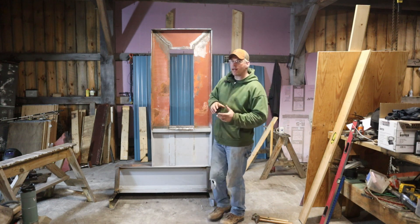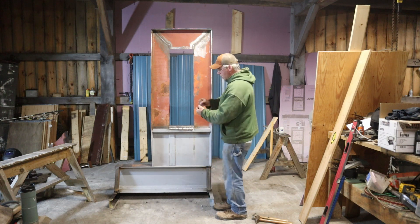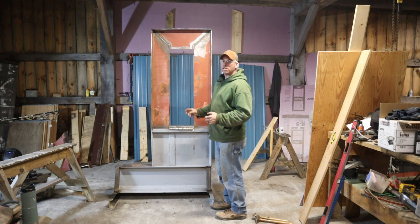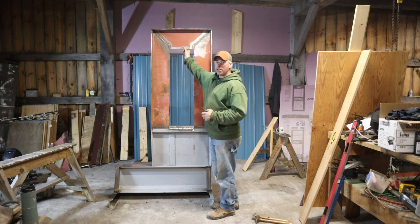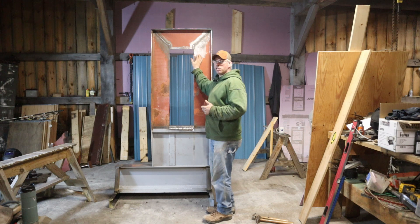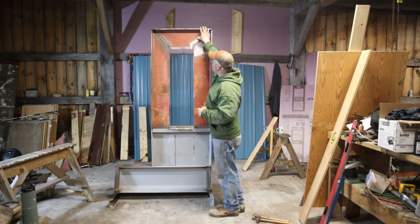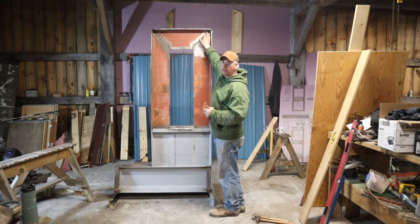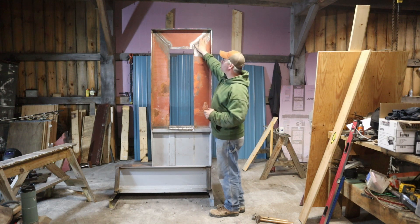The way a press works, it's not like a power hammer — I don't really need full contact with the floor underneath the center. It's actually going to push both ways. This square here is what's going to take all the racking force, all the major force. It's not only going to push against this, it's going to push against that, and they're going to try to tear apart from each other as you're using the press. So I want as much steel in here as I possibly can. That's why I cut it the way I did — I could have cut it thinner, but I wanted to carry it down and get as much of a weld on these corners as possible. Cutting it square would have been a shorter weld joint and I don't think it would have held up as well.